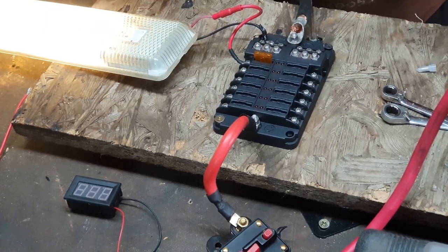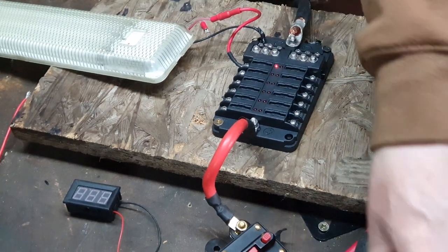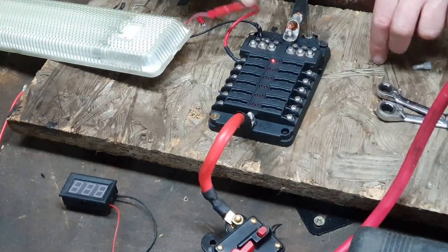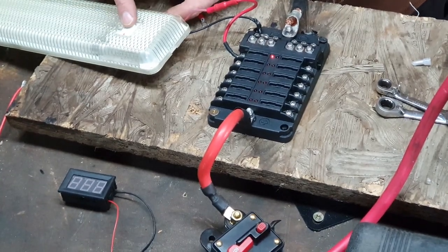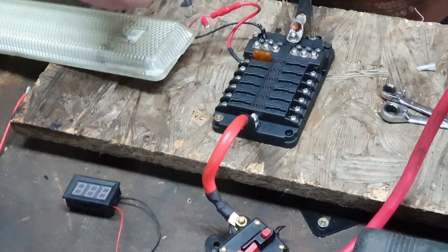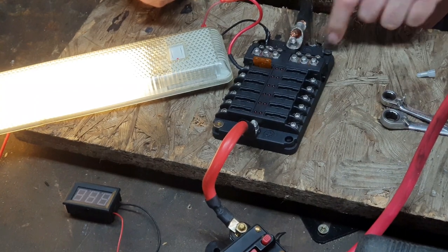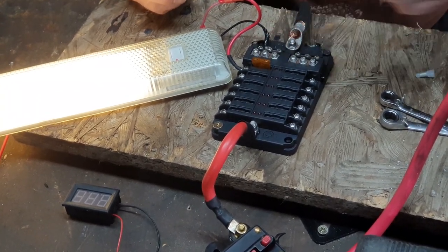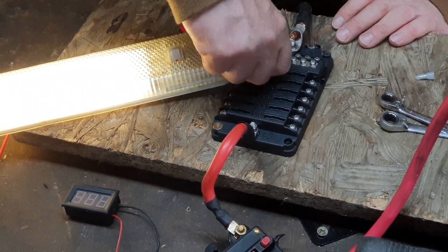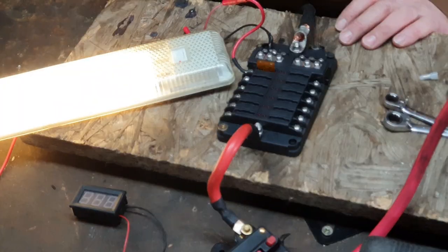So the light is switched on. What happens if the fuse blows? We'll simulate the fuse blowing by removing it. The light goes out but the LED comes on. So at a glance, you can see that the LED has come on to show that there's a fault with that circuit. Always turn off the appliance before you replace the fuse - so turn it off, and now we know which one it is. Get a new fuse, put it in, switch it on, and the light is now on. That's basically how the fuse board works. If there are any issues, we can look at it. I'll go into fuse sizing later on - the fuse size is designed to protect the wire.